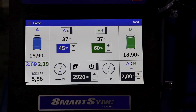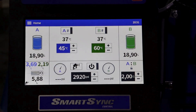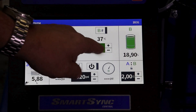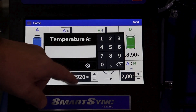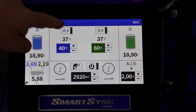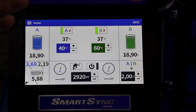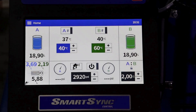In the centre at the top is our temperature control. Here we can see our heater on and off for A heater and B heater, our desired set temperatures — 45 degrees for part A and 60 degrees for part B — and our actual temperatures. We can go in and change the temperature for each side. We would generally turn the heaters on and start our jog cycle to precondition material to get it up to temperature prior to spray application. It is very important that if we stop the pumps, we turn off part A and part B heater to prevent burning of any material in the heaters.